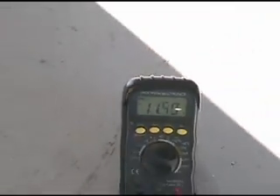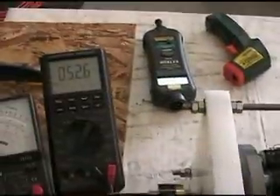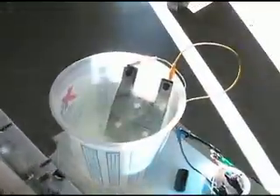We're at 11 volts and there was a bit of gas coming off there — not too bad. We haven't done any calculations, just all preliminary. Just hooked it up and tried it. We're at 52 volts. We'll take the motor up — see the amps and volts going up. We're just spinning. Watch the gas production. RPM is almost 1600. It's drawing 5 amps. Because it's not impedance matched properly, the motor slows down when we add this.